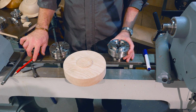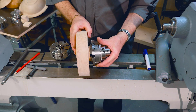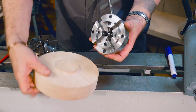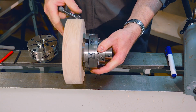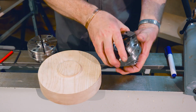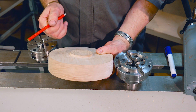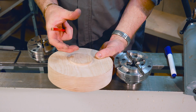The foot we've done at the moment will allow the chuck to come out and we can actually grip inside there. So we'll bring the chuck out just a little bit, get my size. We can grip it in. I can close that down. That would hold it. That will grip it quite nicely. But where we are with that as a grip, yes, it will mark the surface. It will bite in just a tiny bit on the lip here. But the nearer to the circle we are as a true circle, the less damage we will do.